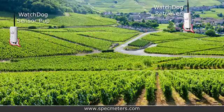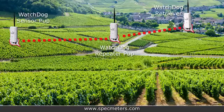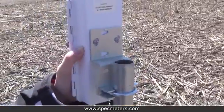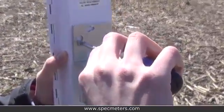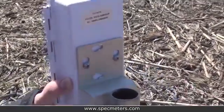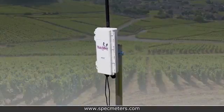For example, if you want to measure environmental data in a low spot of your field but are having trouble communicating with the network from that location, consider adding a repeater pup that can reach the pup in the low spot as well as the other pups or the retriever. Use the bracket, U-bolt, and nuts to mount the pup. Then install or mount any of the pup's external sensors. Remember to close and latch the case door when you're finished.